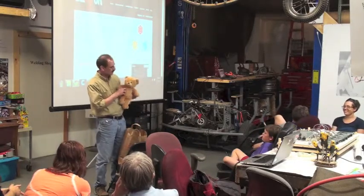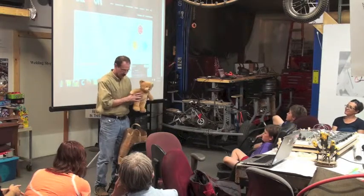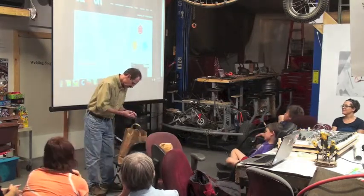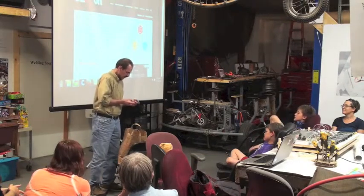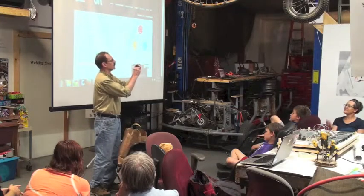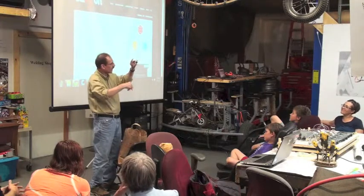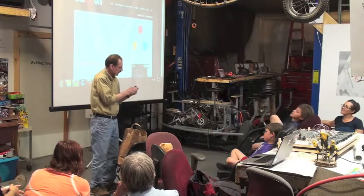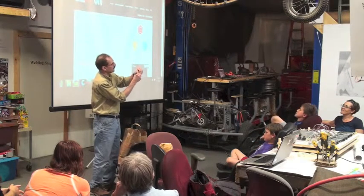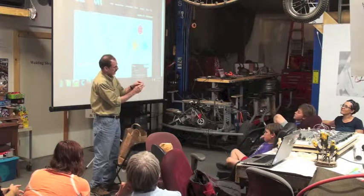So I thought we needed something better than this. You kind of mess up the fur between the eyes, and that didn't work out very well. So I got on SolidWorks and created a new model. This one involves a little lever on top that you push down. Push down, there's a little cam right there that rocks forward and pushes the back. It needed springs in order to push it back up. And of course it goes together like this.